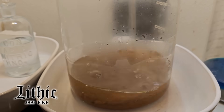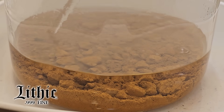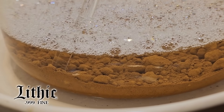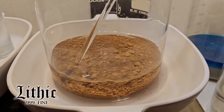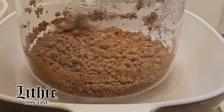I have to go through a series of rinse procedures to get all that old solution off — that solution contains those base metals. If I let it dry and leave those traces behind, I'll be polluting my gold again. I go through hydrochloric acid, distilled water, ammonia, more distilled water, and we're left with this beautiful precipitated gold.